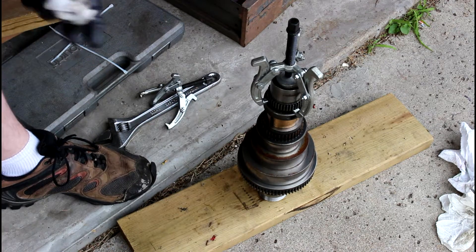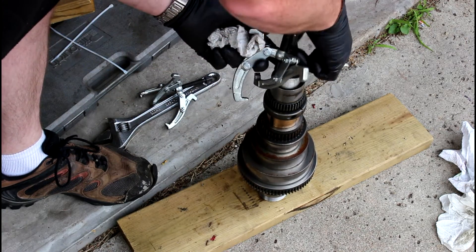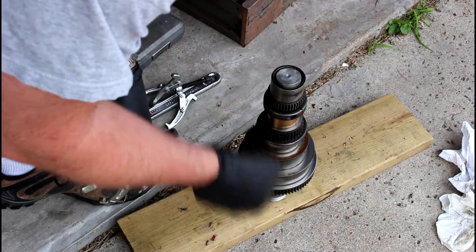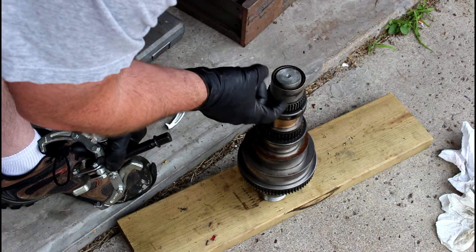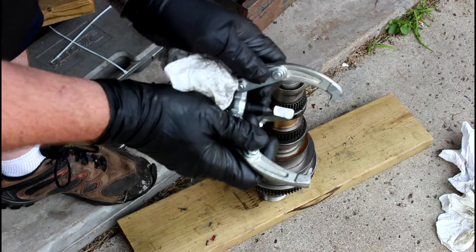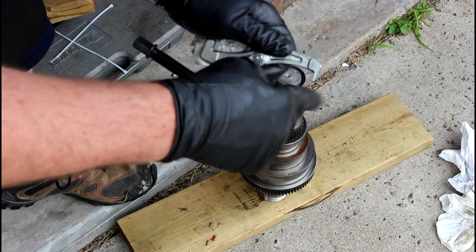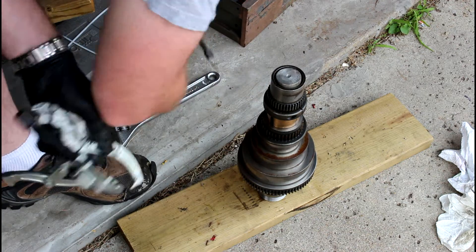First step: we got our outside spindle here and this particular one has a collar on it for the quick change collar closer with a quick release. If you don't have the quick release, if you just have a draw bar, this collar won't be here, so you can just press on the outside — makes it a little easier. Here's a puller I modified — I put it on my mill and milled the ends off because there's usually a big hook there.